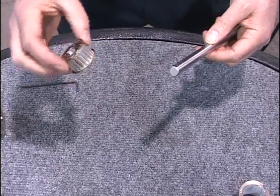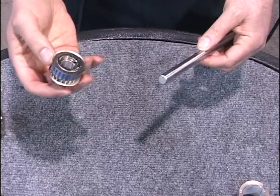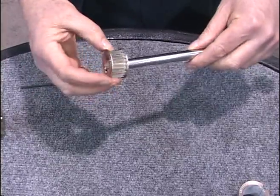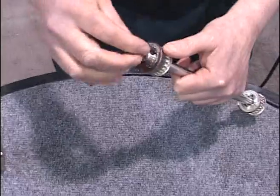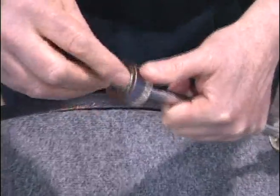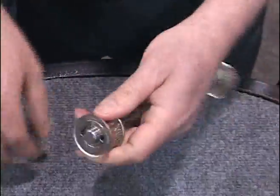I'll demonstrate how the CMT concentric maxi-torque bushing system works. We take a bushing inside a pulley, slide it on the shaft, put it anywhere you'd like, tighten down one lateral screw to the proper torque rating, and you're all done.